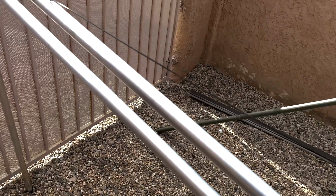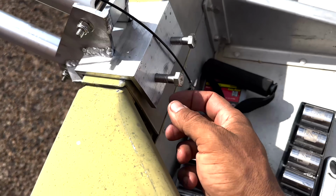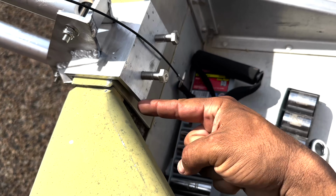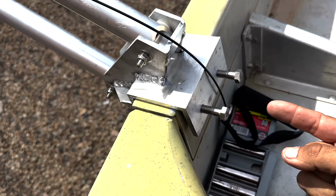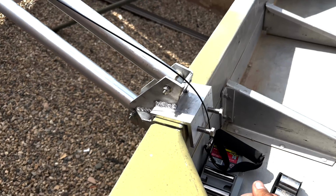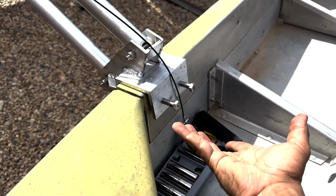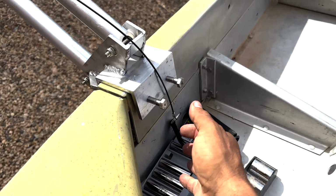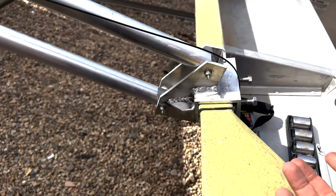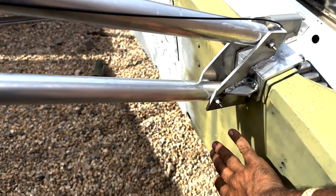Very simplistic design. I love simplicity. I love manual things. This one's actually clamp on. If you're gonna buy the clamp on one, I would actually drill pilot holes into the transom where these can really seat in there and grab in there, because with motor vibration and everything, there's only so much you can do before you have to constantly start retightening these. But some people need a clamp-on version because these won't fit into their garage, and so we did make a clamp-on version. The other best way is to get the bolt-on ones that just bolt right onto the transom.